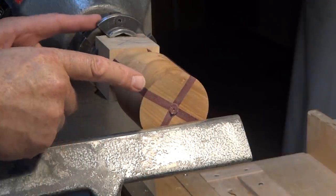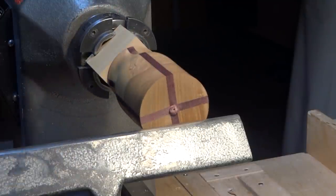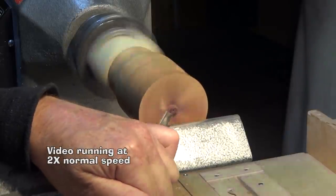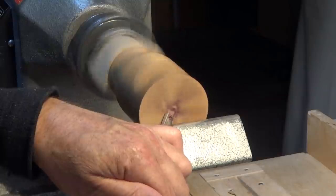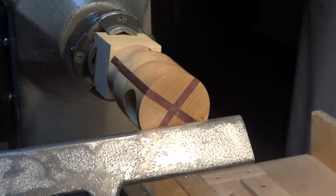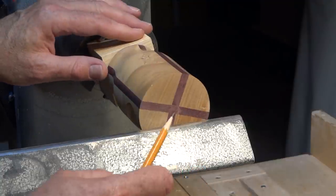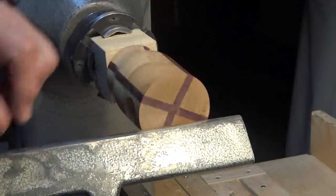The bottom of this is a long way out from the headstock, and the further you come out from the headstock the more chance you're going to have vibration. I'm going to be running this at 1000 RPM, using my quarter inch bowl gouge, and taking the finest cuts I can — I don't want to take any chances on knocking this off. I'm going to drill a recess for my logo coin, so I wanted to make sure I could find the exact center to put the Forstner bit on. I'll put a ring or two on for decoration and sand the bottom.